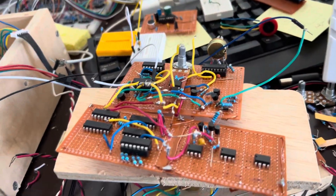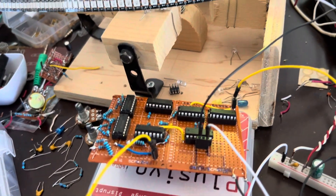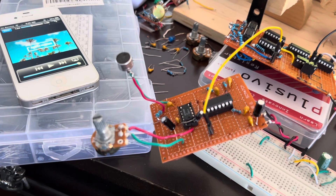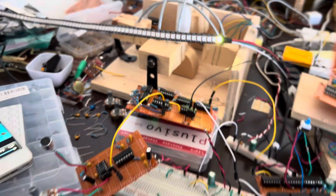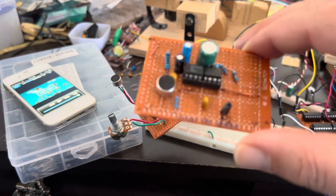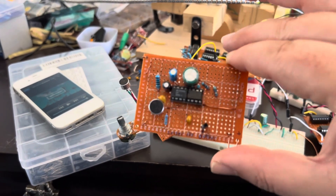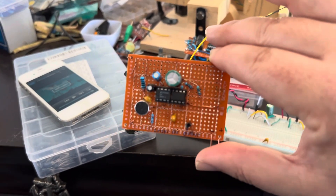There's basically one main NeoPixel driver board, the color module is two boards, the sound processing with ADC and the AND gate is three boards, and the little sound input is four boards. I also have this other one I'm going to incorporate — it's one I built before, making it the fifth board. It's got a microphone input and it basically modifies a one kilohertz wave put out by a 555 timer.